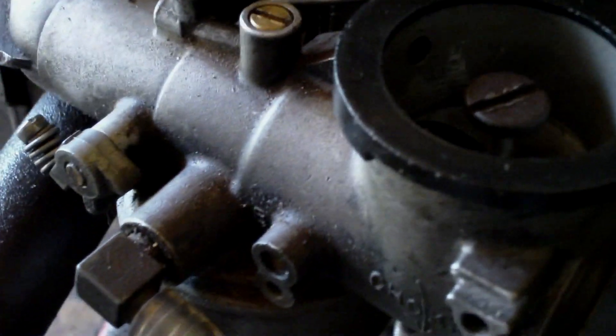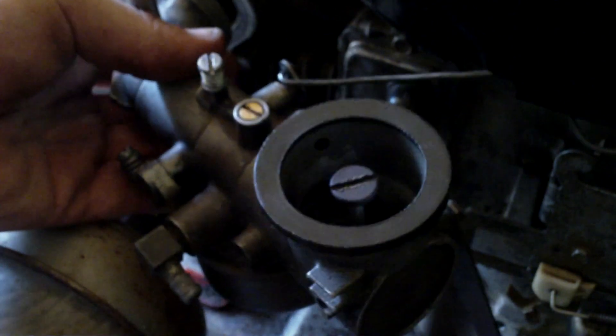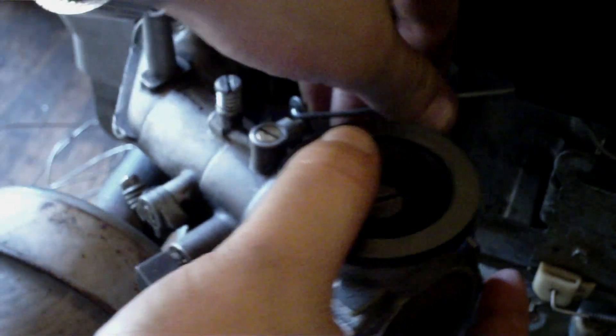It's also the same size bolt that holds your cable clamp. Note that this linkage is not bent in the Z shape — it was just a temporary setup I was in a hurry with, and I also don't have the right governor linkage arm. You can see it's all bent because I didn't want to cut it; I can take one off another engine if I need to. That was just a temporary setup to get the engine running. Now I'm taking these two bolts out — one on top is a star, the bottom is Phillips. After the bolts are loose, the carburetor comes free; pop the fuel line off and wiggle the linkage. If you didn't drain the gas, there'll be a little gas in the bowl.